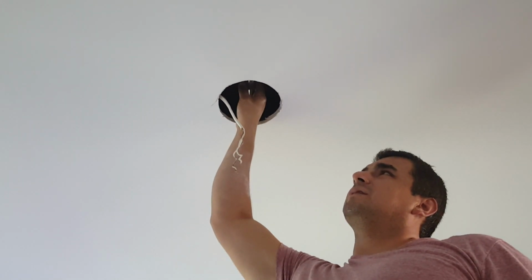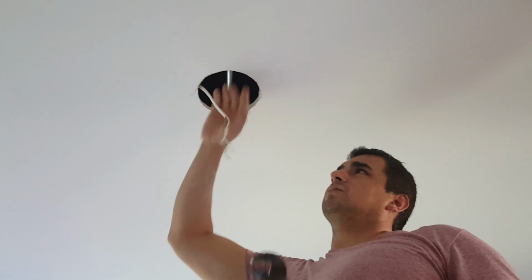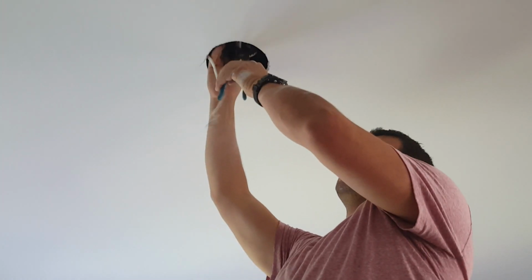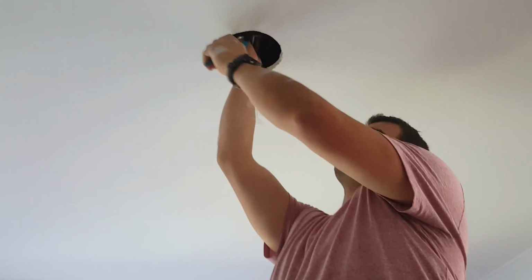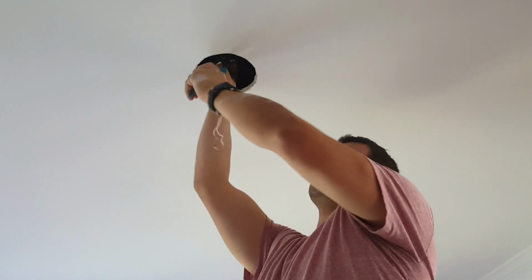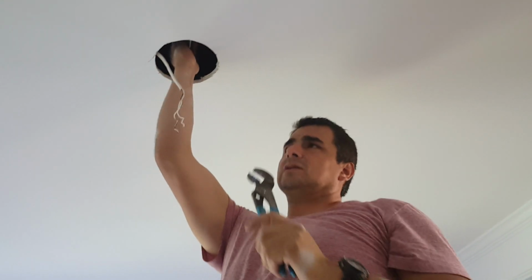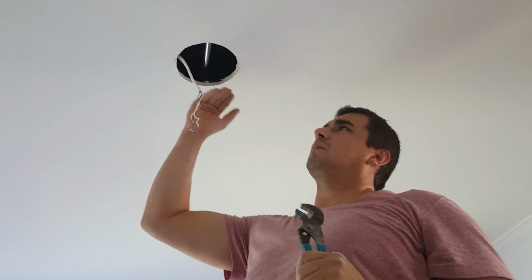So you want to make sure that you have the thicker part. You finish attaching this with your hand. Make sure, obviously, you feel if it went all the way in, but just go ahead and give some more pressure by using a vice grip or something that you can just twist this a little bit more with, and now it's nice and solid. You can start working and putting the box in.